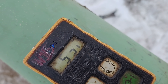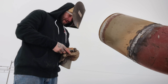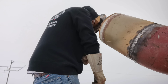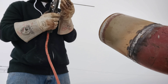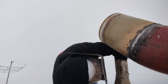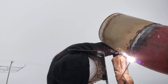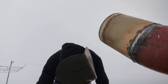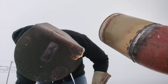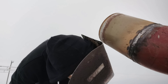I think I'm at 55 on the remote. On my cap on this side I'll run 3/32s — I'll actually drop my heat all the way down to about 30 to start and we'll see if that's any good. 3/32s, see if I can get it in two of them. I'm going to stop — I can already tell I'm too cold. I'm gonna go up to about 35, then let's do 40, because that was just too cold for what I like. Usually I would grind that off — yeah, it's too cold, I don't like it.